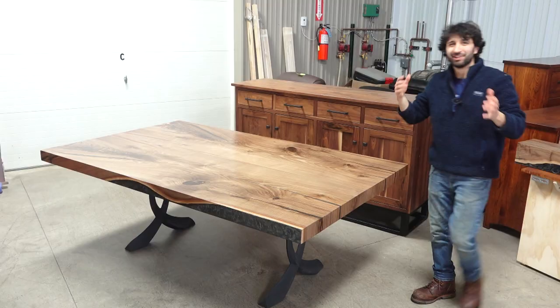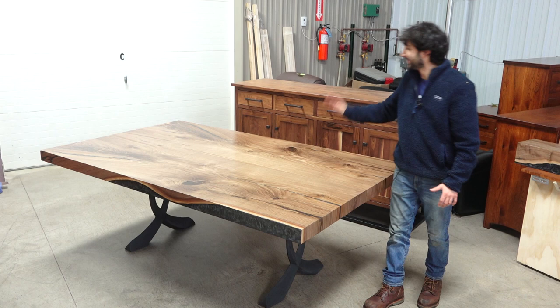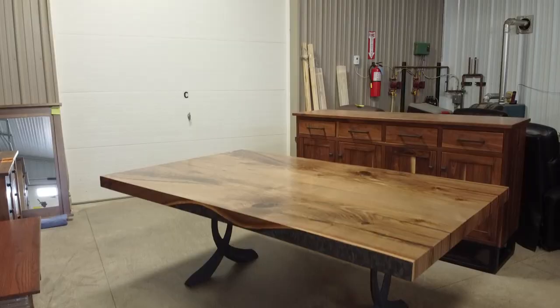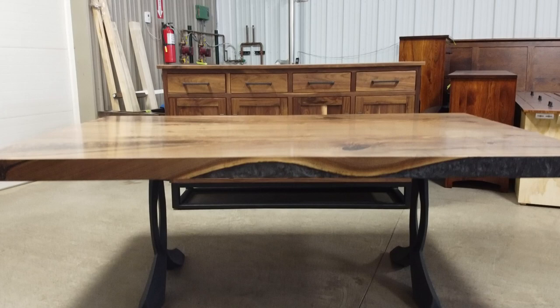And from those sample pieces of plywood, here is the first prototype project. This is a book-matched pair that is now a conference table. This thing is roughly 4x8. It is amazing. It is from two slices that are book-matched, and the seams and everything look amazing. What is also really interesting is we have a grain wrap around all four sides. Using the miter fold blade that Andy Klein invented and is available at Rockler, we were able to fold down the edges of the plywood to create a thicker look.